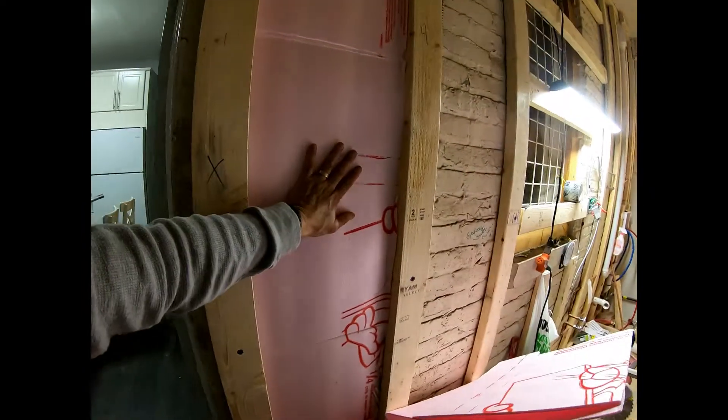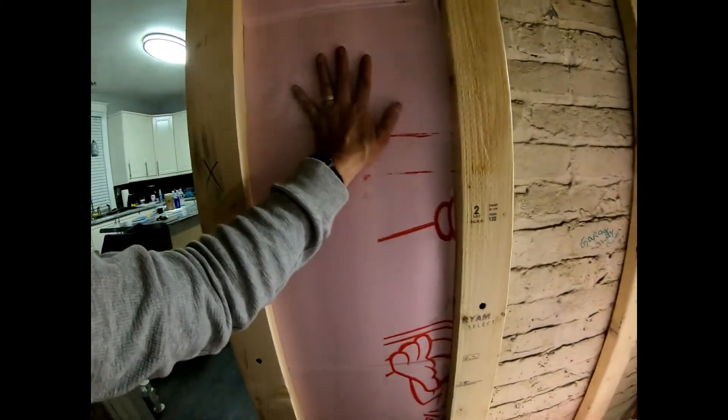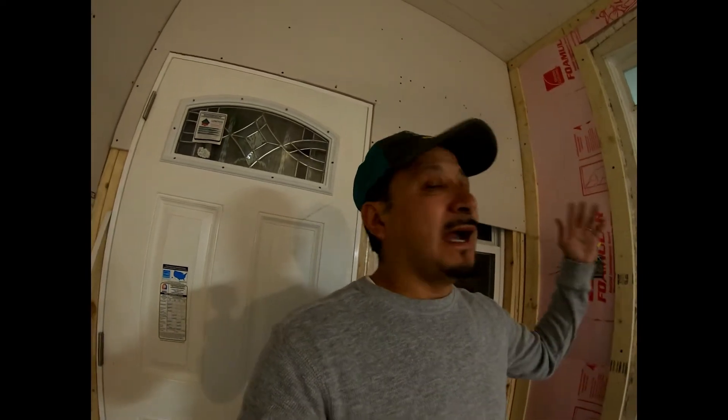Just a little bit of not having this cold wall — when you put the drywall over it, it's gonna feel amazing. Insulate, insulate, insulate — if you want to keep a room and your bills not going through the roof. We actually got an electric baseboard heater we're putting in here — I went with the 120, not the 220 — but we may not even need it back here because it's not even done and it's already 60 degrees.